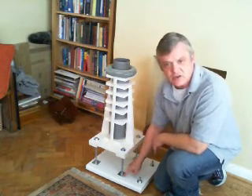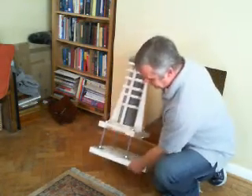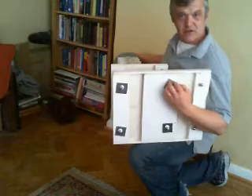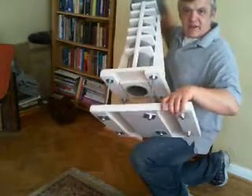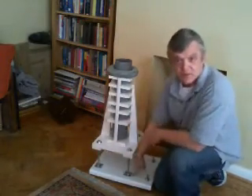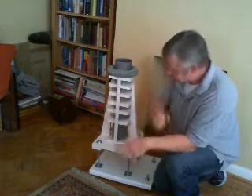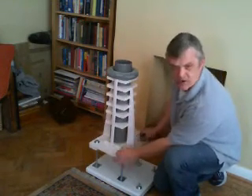On here are some square plate washers — they go above and beneath. There's a dome nut, and when you screw these together it clamps against the two square plates and helps hold it at 90 degrees to the base. The holes I've drilled in the base are at 12 millimeters so the rod just fits through. The two clamping plates clamp it and hold it rigid.